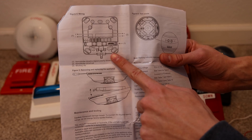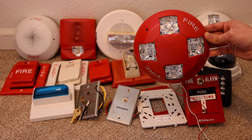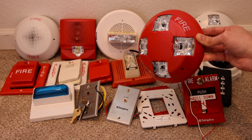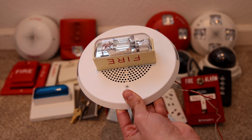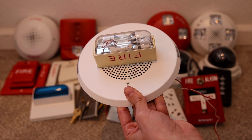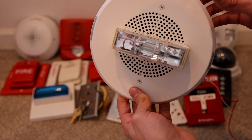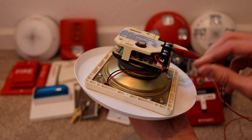And then there are also some holes right there which you can use to test the polarity of the alarm to make sure it's working when it's in use in a building. For those of you that are curious, here's what the mounting bracket looks like — I will be getting a couple in the mail shortly. Here's the strobe-only version, right now flashing at 115 candela. Here's the other chime — this one came set on single stroke, so let's test it out. And it is four wire. I already did test the strobe; the strobe does work just fine.